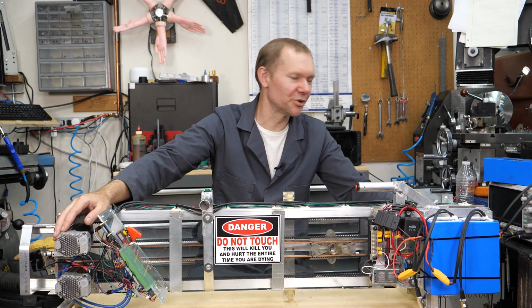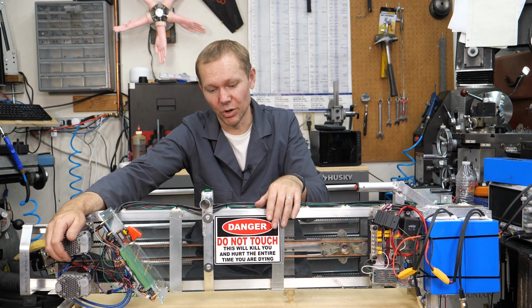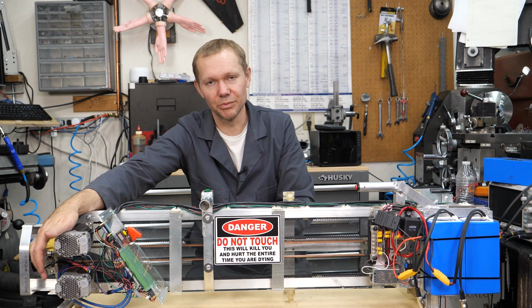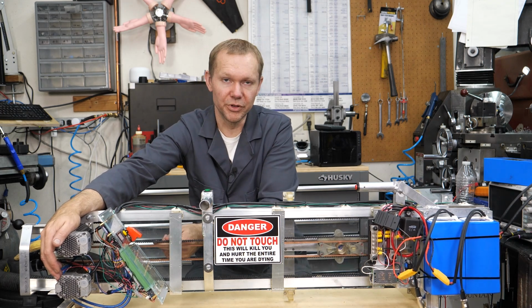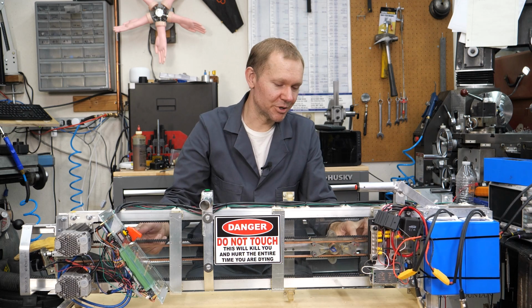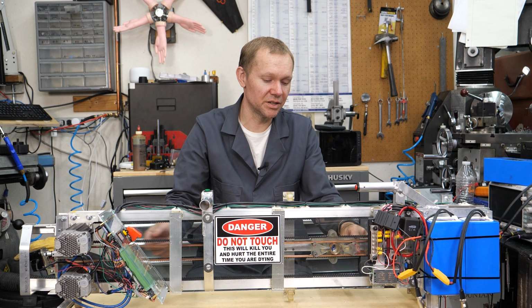And so we did. We put this micro switch on the back, and it came to me, wait a minute, if we have one of the motors enabled and the other motor disabled, the enabled one could overdrive and we could at least run the carriage, just run one motor, and say I'm just moving one belt, and it will move the carriage. But if the carriage were to come up against a stop, check it out, I'm just holding the carriage with my finger, and if I continue to run the belt, well, it spins the solenoid, it was a magnet, spins the solenoid.